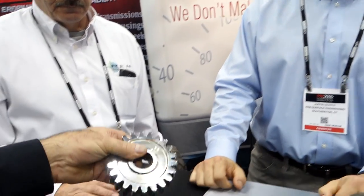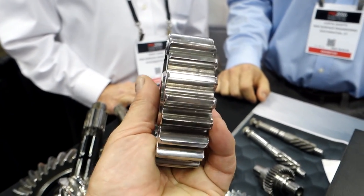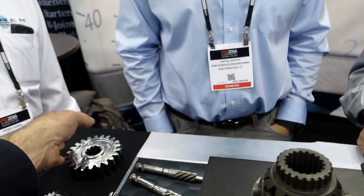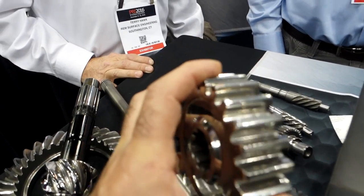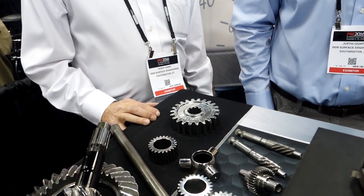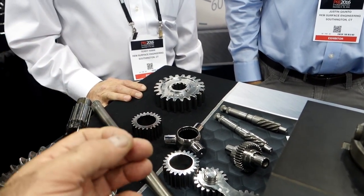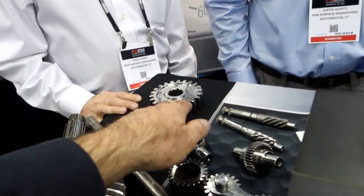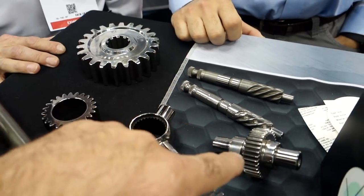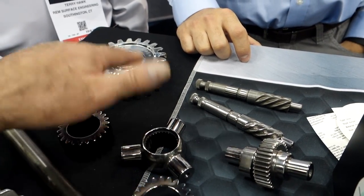Listen, another nice piece here. So again, it's not about being pretty and shiny to look at. It's actually what the surface finish is and how uniform the surface finish is. The reason all of our parts are bright is because we remove the imperfections and light reflects off smooth parts. Now I see some pieces where people don't get down to the root of the gear, all the way down to the middle of the tooth. That is correct. That's choosing the right type of, and it's called media in our process, with different shapes and sizes. That's correct. So you really have to analyze the product and ask what media do I need to use so that it fits into all the nooks and crannies, because all these individual shapes take a different size media than this one, since this has a bigger tooth profile. Something this small is good for this, but it may not get into this. That's correct.